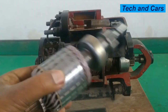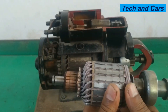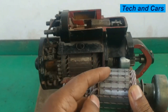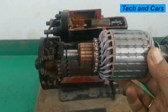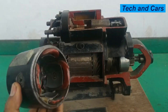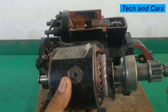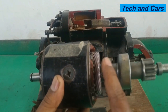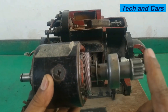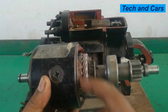The resultant effect will tend to rotate the armature. The armature winding has electrical connections and windings; when current is supplied through the commutator, it flows through the winding and magnetizes the armature. The reaction between the two magnetic fields — field winding and armature — rotates the armature. That rotation is transferred to the flywheel via the pinion, cranking the engine.